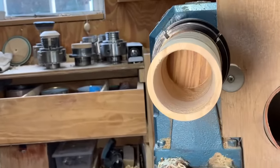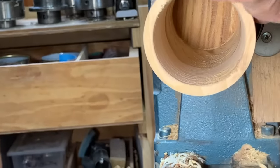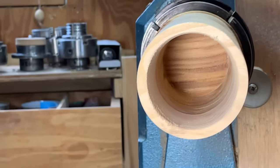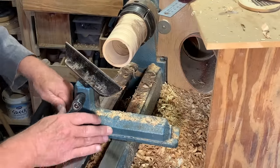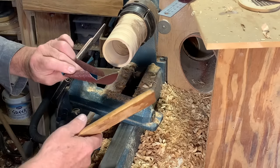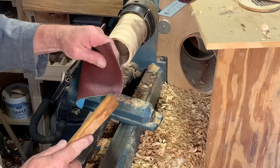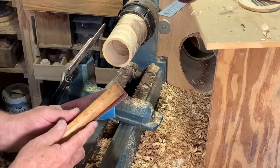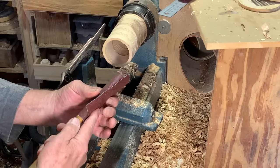So as you can see, it's pretty clean in the bottom. There's a bit of picked up grain on the side grain, as always is very difficult to get, and that will have to sand out. Now my fingers don't reach the bottom, so I use a stick, half dowel, starting off with 80 grit, so I can get at the bottom all right. So that goes into the stick there. It's just got a slit done on the bandsaw. That goes round, and that's what I'm sanding with.